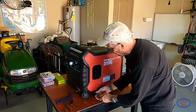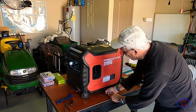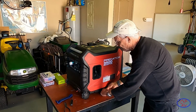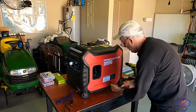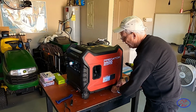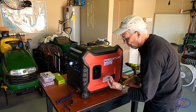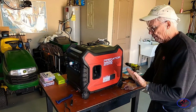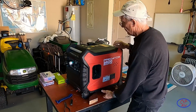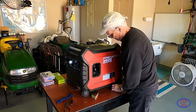Now I've undone them before, and I knew I was going to probably take it back apart, but there are 3 bolts down here that are screwed in at the bottom. I've still got a little residual oil here from all the oil that has leaked down there. Not from running it again, because I just cleaned it up, but I obviously missed a little bit in that process. So those 3 are out. Okay, so what I did was I just grabbed 2 small pieces of 2x4. We're going to create a little jack stand here. Just jack this up and set it on it.